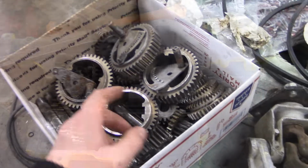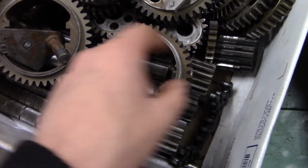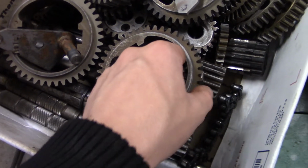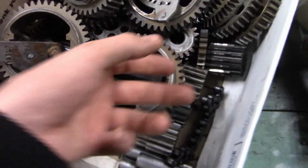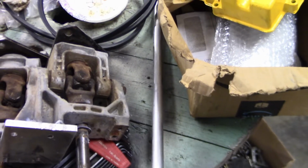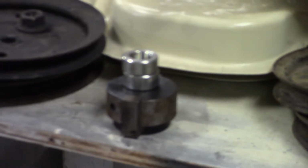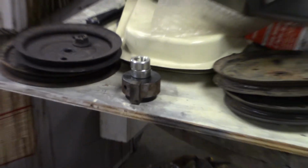But I'm going to be watching Cowgirl Motorsport's locker video on how he's done it. He sticks 2 extra spider gears in here, not on the cross pin, but on here with some bolts to space them and whatnot. And then pretty much locked up. It's super simple. This is the solid axle, which will be going in the back, and I've also got the hub and lock collars ready to be installed.